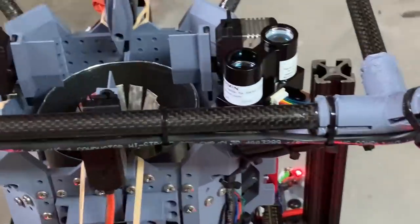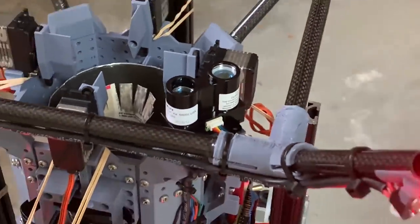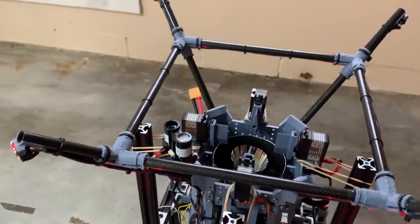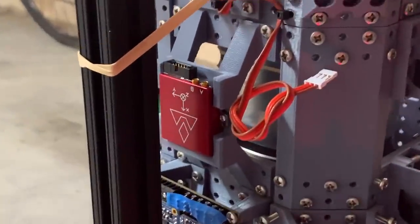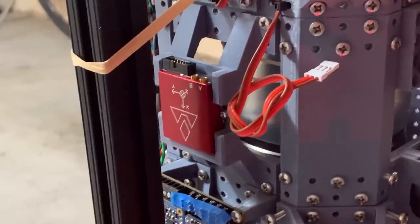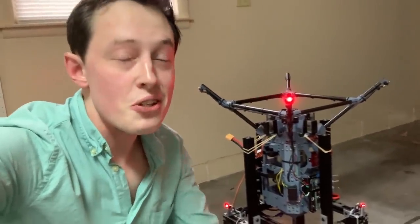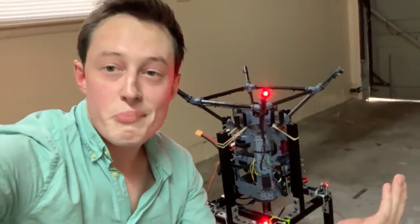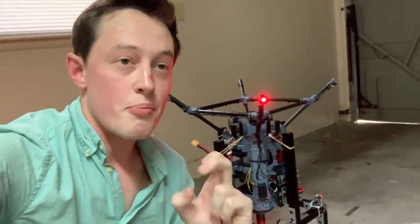It's still pretty hard to tell what's going on here since the craft is upside down, but this is a LiDAR sensor looking at the ground. Specifically, it is a LiDAR Lite V3 from Garmin — it's good to about 40 meters up, and that's going to help us with really high precision hovering when we're close to the ground. For the rest of inertial navigation and navigation in general, we're using the VectorNav VN300 sensor — it's an AHRS, IMU, dual GPS, and really high precision. I want to give a huge thanks to VectorNav for sending me this IMU specifically for this project. They're a partial sponsor of this project, so thank you very much to VectorNav. This project wouldn't be possible without such a high precision IMU.